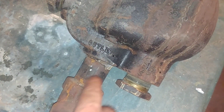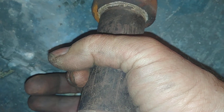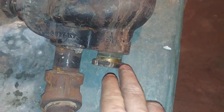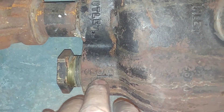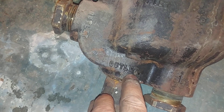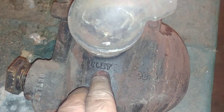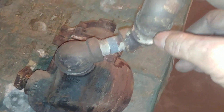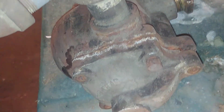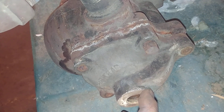It is an inch and a quarter. You can usually tell inch and a quarter because when you wrap your thumb and index finger around it, they slightly overlap. We have a clean-out plug here - it says clean-out cap - and then we have an outlet here and an outlet here. You can use either one, but the outlet for the bottom was used, so the other outlet is plugged. There's an inlet on this side and an inlet on the other side. Steam, air, and water enter through here, go into the float body. The air should be ejected and the water allowed to drain off, with the steam trapped in the trap.